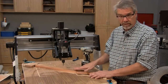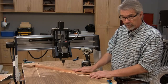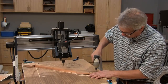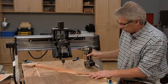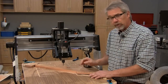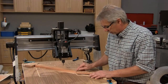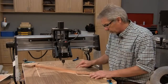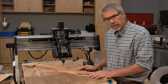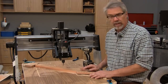We've just finished machining the front of the neck. Now we have to flip it over and locate it exactly where it needs to be carved from behind. Remember those location holes? They're key to helping us get it in the right spot. I also like to use double stick tape at this point because there's a lot of pressure going back and forth as the machine cuts. There are basically two more cuts: the first is to carve the arc of the neck using a ball end bit with a series of passes across the neck. Then we'll change to a half inch mill end bit and machine the back face of the peg head.